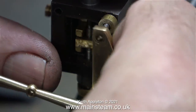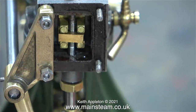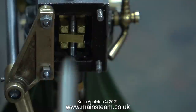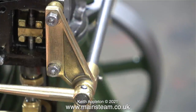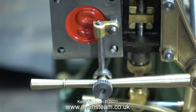After fitting the spacers I can start to refit the reversing gear, starting with this bracket. I did the same at the other end and loosely fitted that bracket as well. Nothing was binding and everything was in the right position, so it was a simple job to tighten the bolts to hold the bracket securely against the steam chest. I then turned the engine round and tightened the nuts on the bracket at the other end, so now the reversing shaft, the reversing arm, and the expansion links are all in the right position. To fit the locking mechanism I just used the steam chest cover fitted the wrong way round and mounted it back on there.